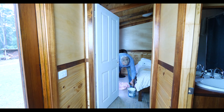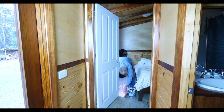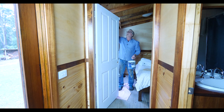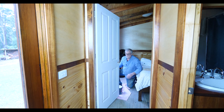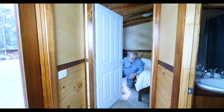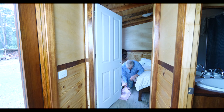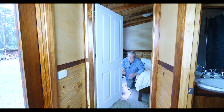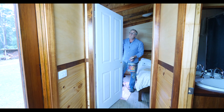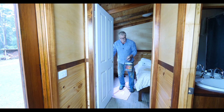With this edge I do put a bit of cloth down just to catch the splatters. Now this door itself has already got a factory primer — just a water-based primer. The edges are bare timber and I'm just putting acrylic gloss over that, so that's going to be the primer. With a water-based acrylic it doesn't have to be primed. If I was going to paint this with oil-based enamel, then most definitely it would have to be primed or undercoated — I'd probably just use an undercoat.